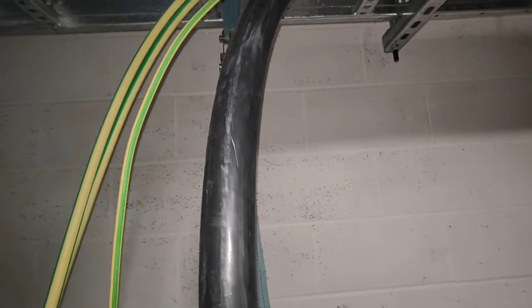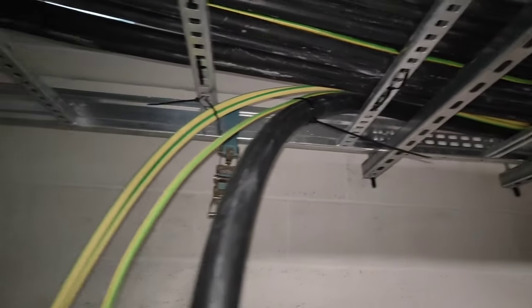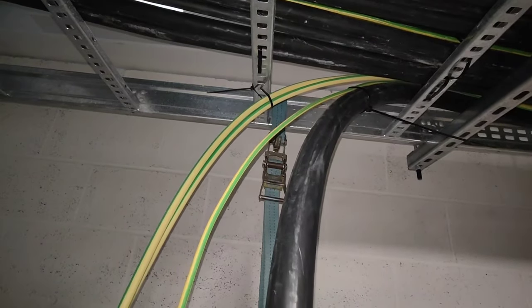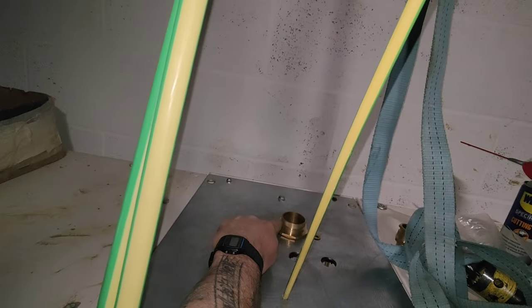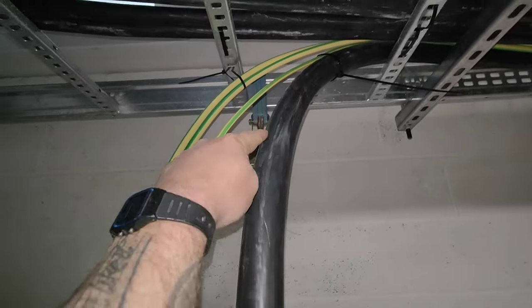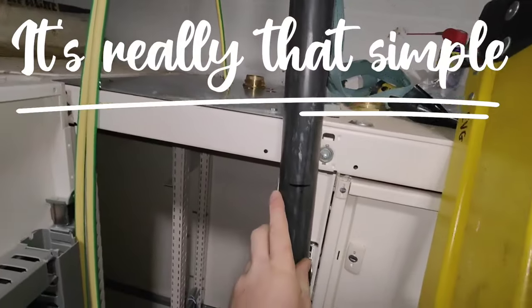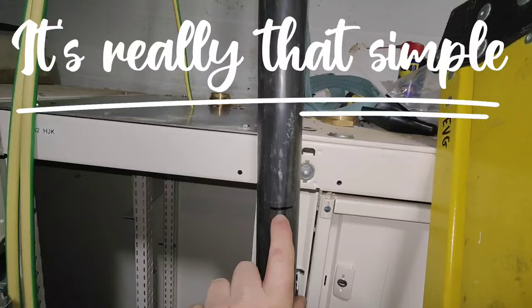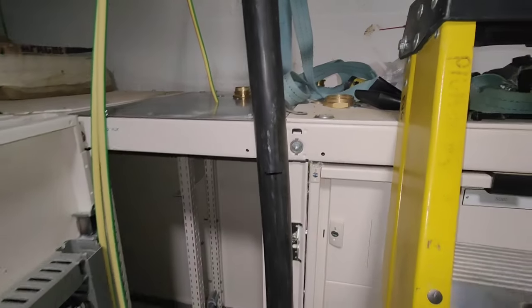Now, mimic its natural path — you get a smaller piece of cable that you can bend in place. And as long as you transfer, if you go into that side of the cone, as long as you transfer on top of the cable, it will come down, stay on top of the cable, and that is your true measure for your armour cut. You can't go wrong, trust me. Thank you.